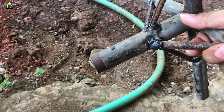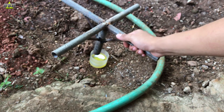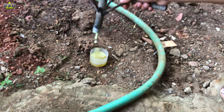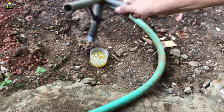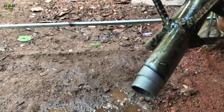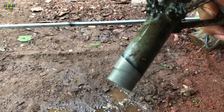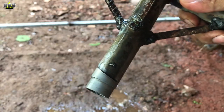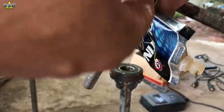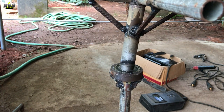The top part of my table to which the pipe is connected — that pipe is rusted. I have a chemical here: if I dip it in this chemical the rust will disappear immediately. I have dipped it in the chemical, which is like acid, and as you can see the rust which was there is gone completely and how clean it has become. Now I will neutralize this by dipping it in caustic soda. Once the rust was gone and I neutralized it, I will apply grease on top.